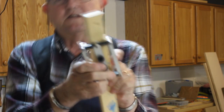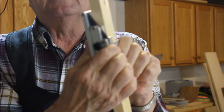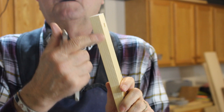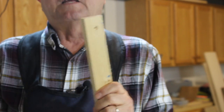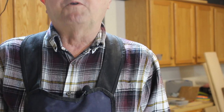The way this works is you put it on a piece of wood and it self-centers. So what we're going to do is I'm going to take this and pretend that it's a face frame. I'm going to drill a couple dowel holes here, a couple dowel holes in the end of a piece, and we're going to dowel them together and just see how accurate it is. Stick around and I'll be right back.